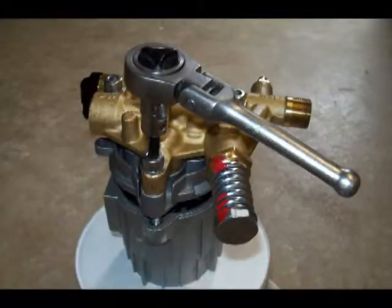To change oil in this pump, loosen the three Allen screws shown here. Don't remove completely — this will be spring-loaded. Then you can pour out the old oil and pour in 5 ounces of 30 weight non-detergent new oil. Be sure that the O-ring stays in place and you may want to retain it with a little bit of grease. This O-ring will be reusable.